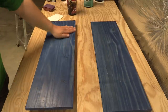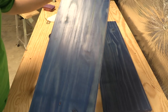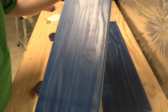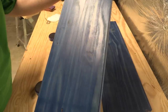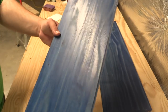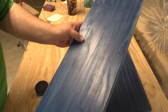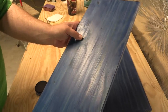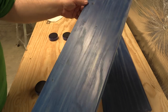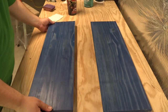This feels still pretty rough, and I'm not going to get too heavy with the sanding until I've gotten my second coat on there. You can see that some sections pretty much took all the new finish off. You can see where it stayed in some areas and where it's come off in others. Now we're going to basically fill those gaps in with our next coat.